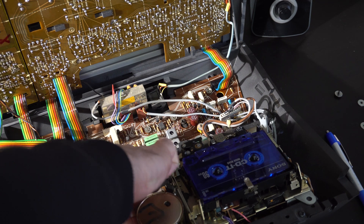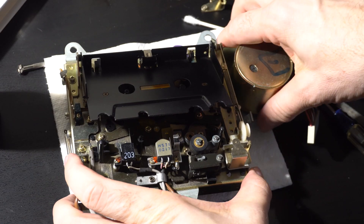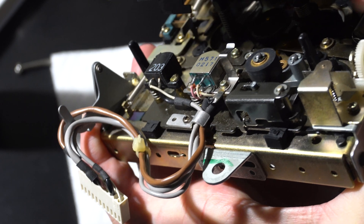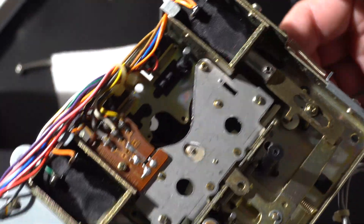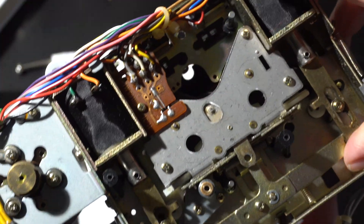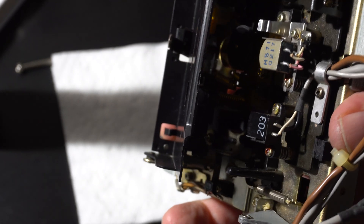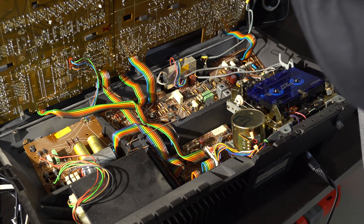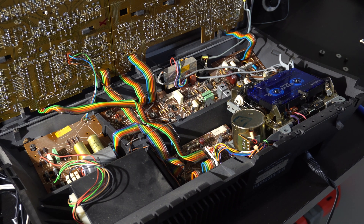What could I have done differently wrong with the play? So here's the problem: when I initially put it back together, this brake right here had popped outside there. This little piece goes on the inside of this reel. A good thing to do is just to test the brakes — you can verify these take-up reels are loose before you put this back together. I had in fact introduced a play problem by positioning one of the brakes wrong. All these cassette decks have different little brakes to stop the reels from spilling out tape. I think I like the Yamaha design best — it's kind of like a car where the brake is disengaged unless you engage it. Whereas on this Bang & Olufsen, the brakes are always engaged unless the solenoid disengages them. Anyway, that about wraps the brake problem up.